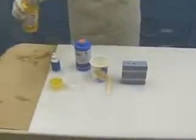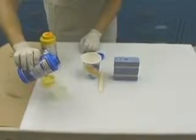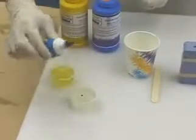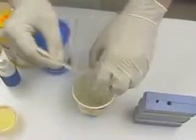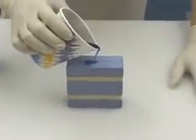A small amount of Smooth-Cast 300 Part A and B is dispensed in equal amounts. To give the finished casting a little color, a couple of drops of So-Strong Color Tint is pre-mixed with Part B. Parts A and B are then mixed thoroughly for about a minute. The mixture is then carefully poured into the pour vent.